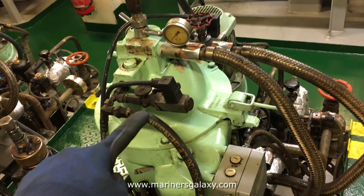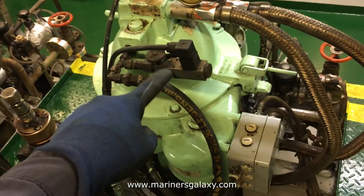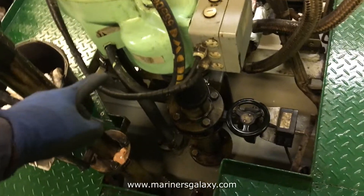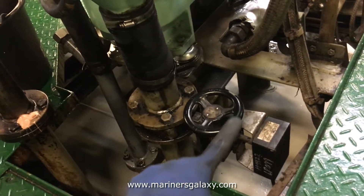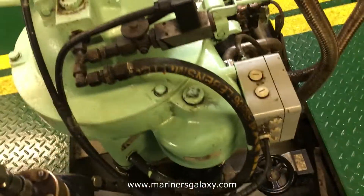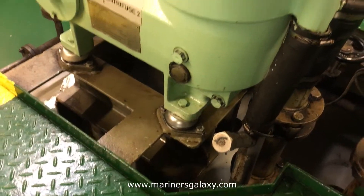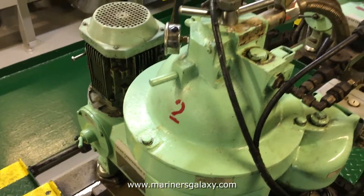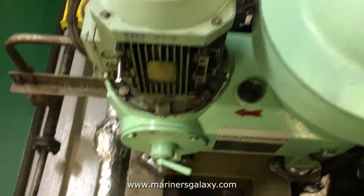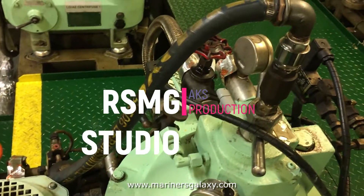This is the dirty water discharge outlet, which has a pressure sensor and comes with a throttle valve inside. It goes into the same pipe where the desludged water is — that pressure sensor is for back pressure and this is for the dirty water discharge. Then you have the sludge pipe, the dirty water outlet, and again the sludge valve with the safety switch so that you cannot operate if the purifier outlet valve is closed. On the other side it's pretty much similar to the HFO purifier, and same as that you have the clutch inside. Thank you for watching.